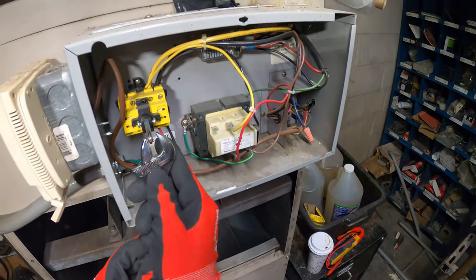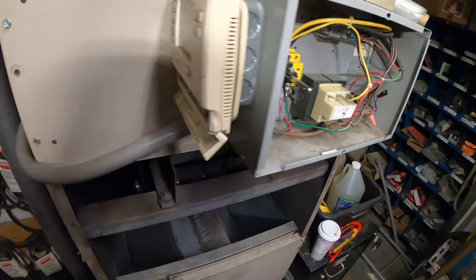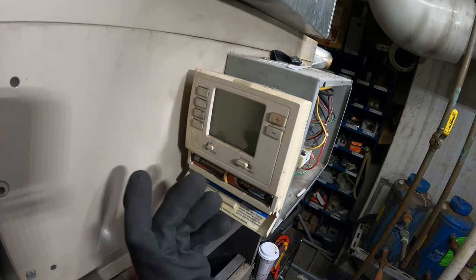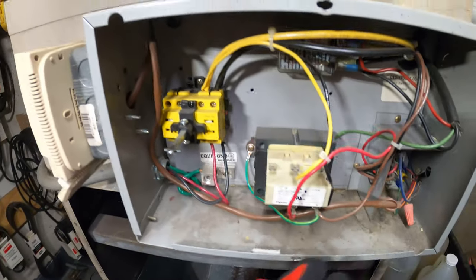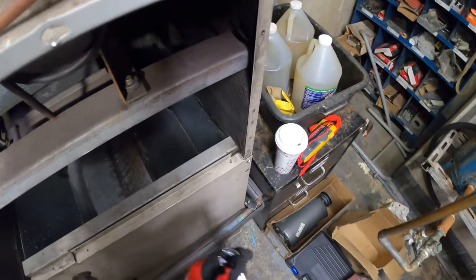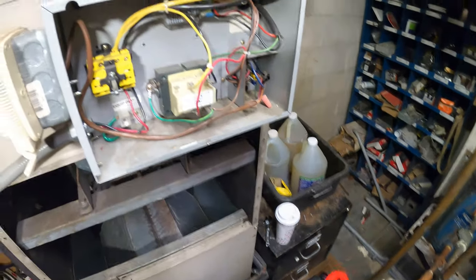Let's take a quick look over here and see what's going on. Let's turn this on — power's now on. The thermostat doesn't even work. Does it have a common? It does — there's a common here. So even though those batteries could possibly be bad, there's still a common here.